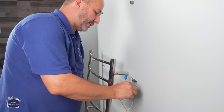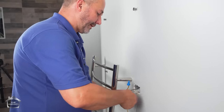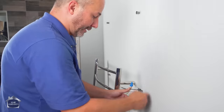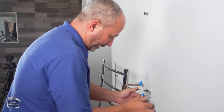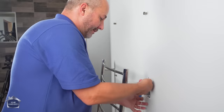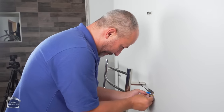No sense having extra wire on there. When you're done, you shouldn't see any exposed wire beneath the Marrette cap. That's just one way that you can be confident that when you tuck this into the box, it's not going to make contact with any other exposed wire in there, like the ground wire, right? You don't want anything else to be in touch with that ground wire.